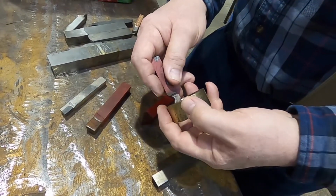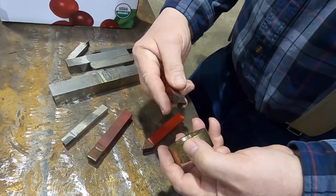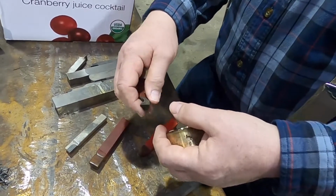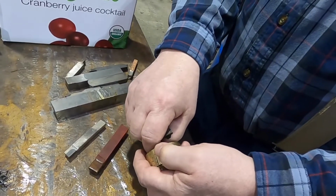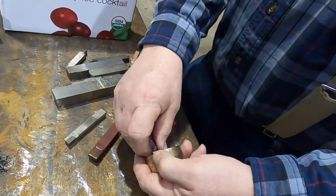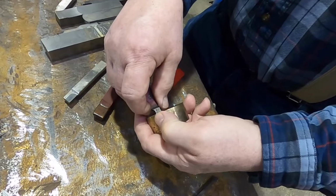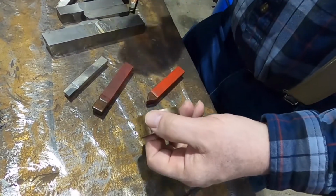One of the things you could have on this, let's say that this was in a blind bore, and you had your snap ring in a groove that was deeper than what the snap ring takes, so you can totally compress it like with a ring compressor. Put something in here, and then it will push down here until it comes to this and nicely ride in. And the other thing it will do is, see, it will ride in and it will stop it from moving in this direction. But if you want to take it apart again, you can press it this way. It will compress the ring and come back out.